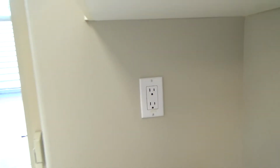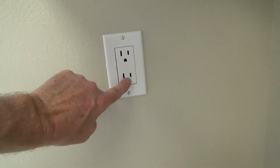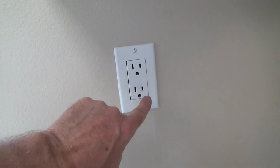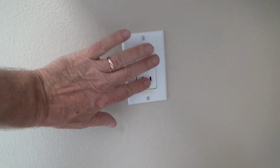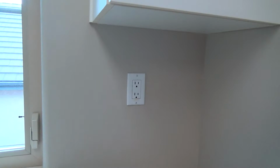And you know why? Because they might have broken the tabs on the side of this and had power only when you hit the light switch by the door, and your lamp to your bed is supposed to be plugged in here, not here. You'll have power all the time here, no power here unless you hit the light switch by your bed. So check that out next time you think your lamp is not working properly.